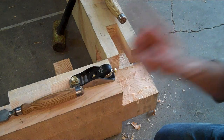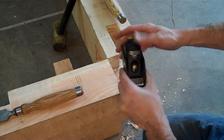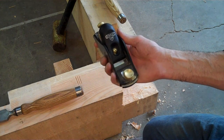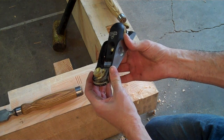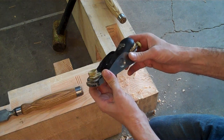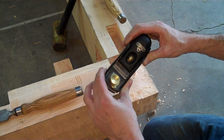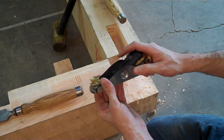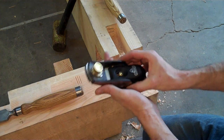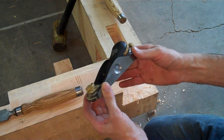And it's been fun to learn how to use these old tools, like this block plane right here. Stanley was the benchmark for years and years of really high quality hand tools, especially planes. This is this Stanley Sweetheart. Unfortunately, they went cheap the last several years. You'll see their stuff in Home Depot and Lowe's, and they have planes you can buy for about $20, $25, and they're garbage. But just recently they started to recreate their really nice old style with modern materials, A2 tool steel, heavy duty solid cast, like this one right here, that's just a beautiful tool.